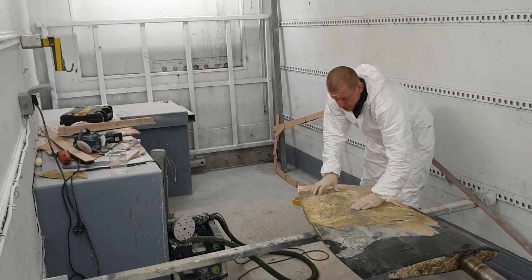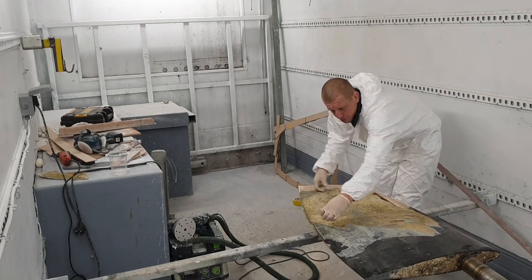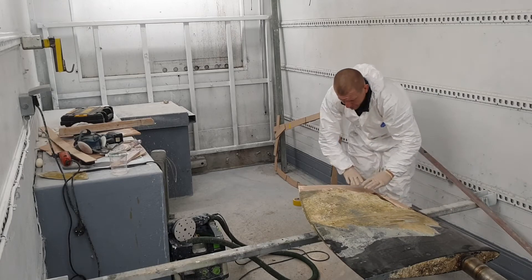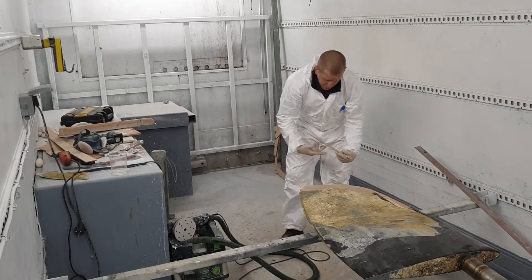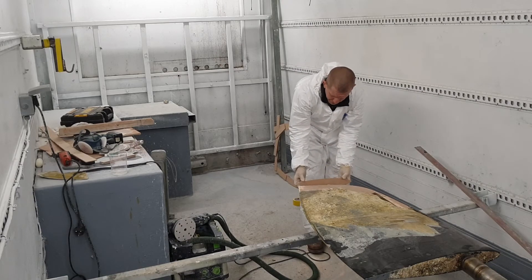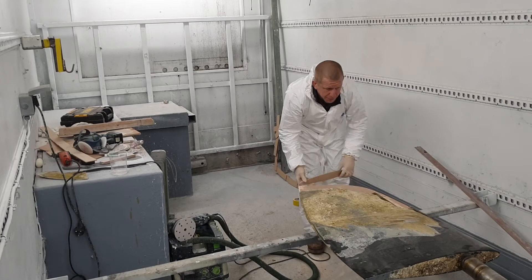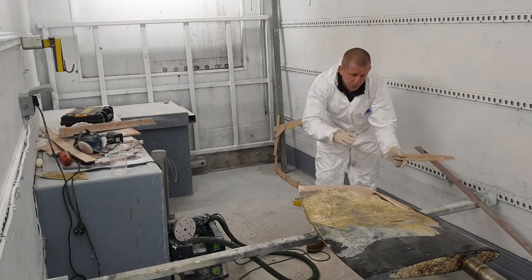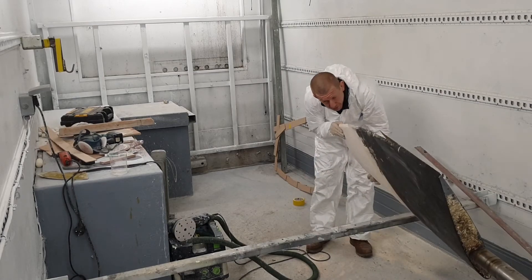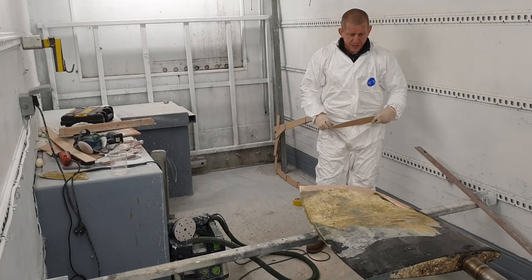What we'll do is flip it over and do the same on the other side - it will shrink back a little and straighten out, or we can do the detail work once the other side is filled up. But all the time we're loading one side up it's really going against that. So at this stage we'll start to do this side. There's a bit more skin missing on this side but same process - cut off the loose. The foam is the load shape so we just replace filler on top of what the skin would have been - about three mil filler on top. We've got the part template back on the other way around on this side to give us something to go off. Fill this up and once we get this one pretty much filled to the same as the other one, we start longboarding, looking down the back edge, making sure they're straight.